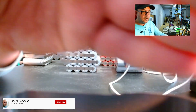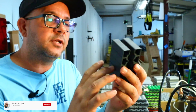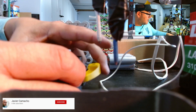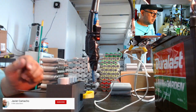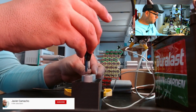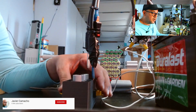Let me show you really fast how I use it — you may have seen this before. I have a battery holder that I 3D printed myself; if you want one, let me know. I've got my batteries here and I'm using a small clamp to hold them together. For my strips I'm using 0.2 millimeter nickel strips — I tried 0.1 and 0.15 but 0.2 works best for me. You can try which one works best for you.